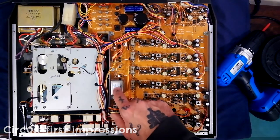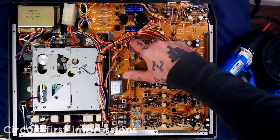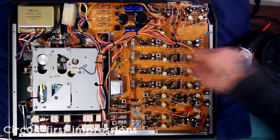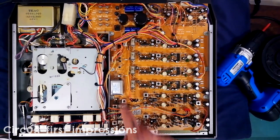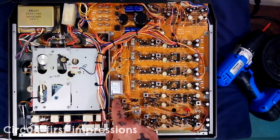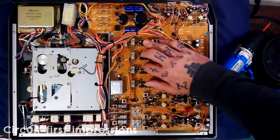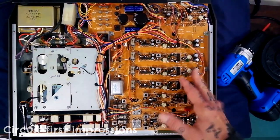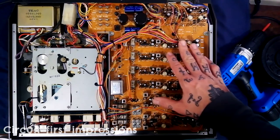This is going to be your erase oscillator — 60 kilohertz it says. These little relays change whether the record and playback head is attached to the record or playback sections of the amplifier. Four inductors here will be pairing with capacitors — those are the individual oscillators for the record AC bias. Either Dolby and your op-amps, or op-amps and your Dolby — somewhat similar to what you'd see in most record/playback amplifier circuits. Transport logic is down here and here's your transport.